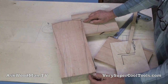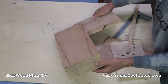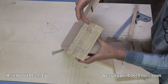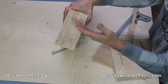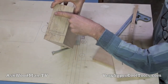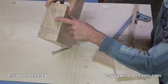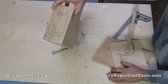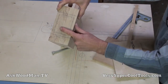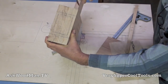That first line was just whatever it worked out to be when I swung that arc and pulled in to make that four inches. This is going to end up just a little bit bigger, but I want to stay with a standard angle in case I have to go back to it. On the bottom I've got this marked out — this is where it's going to get cut off. I'll cut this off with a taper jig on the band saw. I've decided to route into the bottom of this — this is going to get removed — and I'm going to route down into here probably an eighth of an inch. I'm going to set in a UHMW pad here on the bottom so whoever is using this can shove it around on a wood or concrete floor and it'll slide real easy. Another reason is that with straight end grain like this, the fibers of the wood are just open, like a whole bunch of straws.